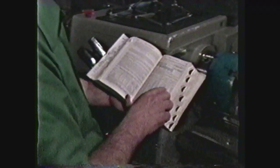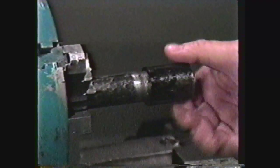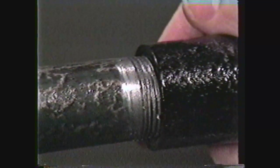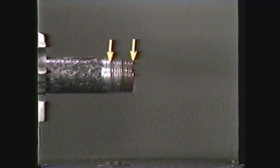The length of the tapered thread can be found in Machinery's Handbook. The large end of the tapered thread will have approximately two slightly imperfect threads which will not accept a mating part. The length of effective thread plus the length of the imperfect thread gives the length of taper that must be cut on the end of the pipe.